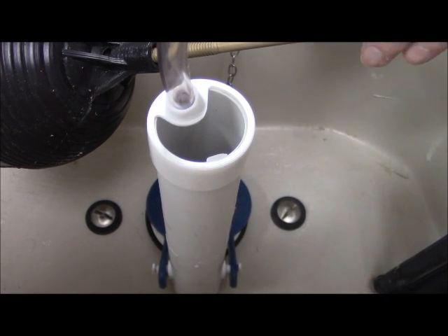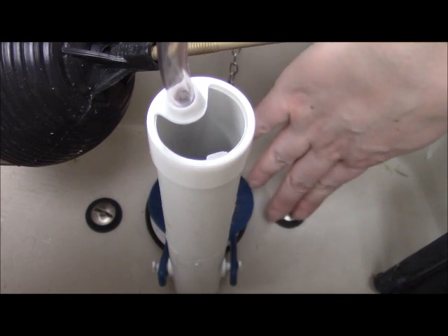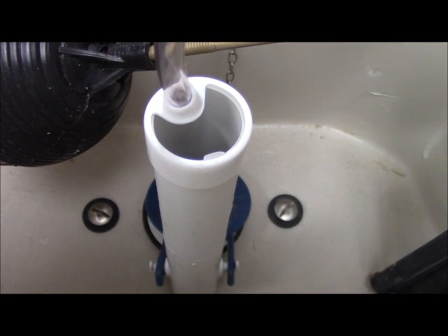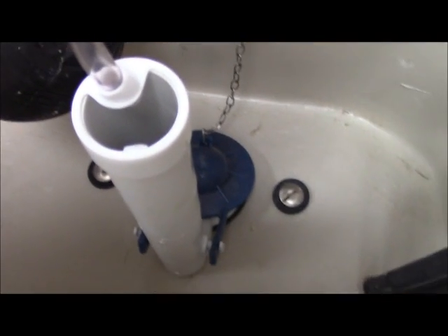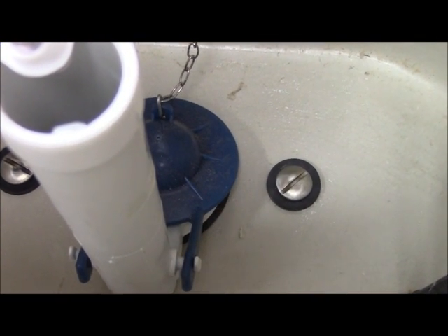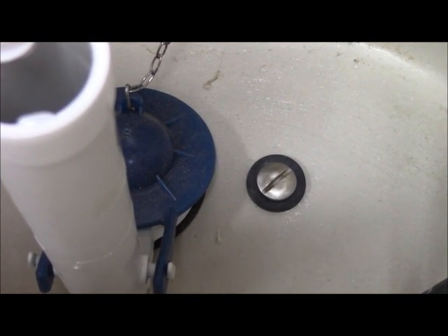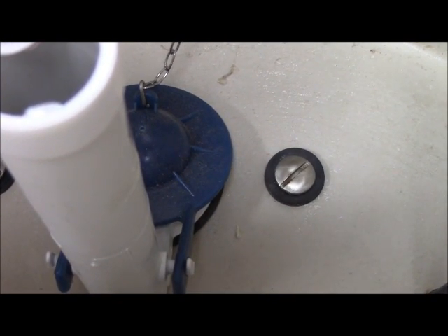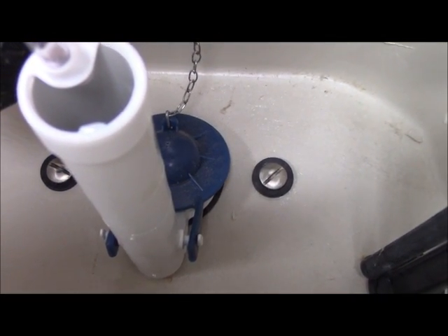The last part of your toilet you're probably going to need to replace are the little bolts down here. In two-piece toilets, these are the bolts that hold the tank to the bowl. They can easily get corroded, especially if you're not using a good sturdy brass or stainless steel set. If you have a one-piece toilet you won't have them at all. Whenever you take your toilet tank off to replace a flush valve or anything like that, you're going to want to replace the tank-to-bowl bolts and the gasket underneath — it's just good practice.